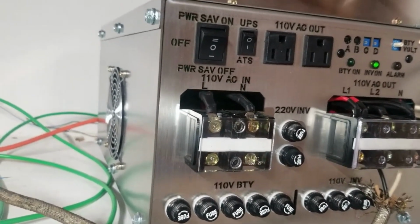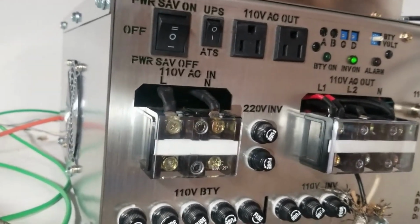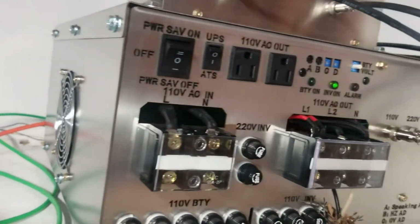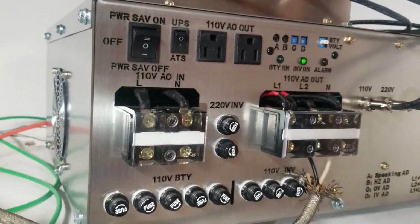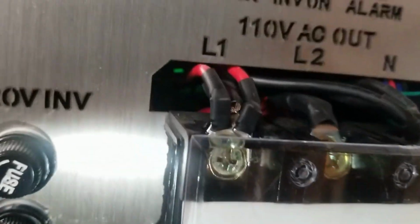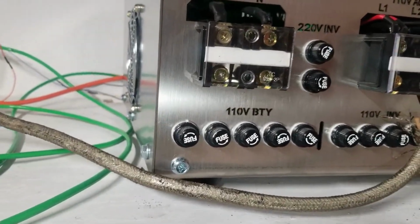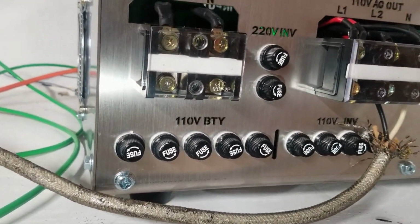And on top of it, this is supposed to be a 9,000 watt. I don't think this thing will go to 5,000. The house goes around 5,000 watts. If this thing dies, it tells you it didn't go over 5,000 watts. I'm not trying to break the inverter. That's the last one I have in here. I'm not trying to break it. So I'm only using one leg. See, I'm using leg 2. I'm bringing only 120 into the house. I think later on I'll probably try something for 220 outside the house. Okay, this is a, what do you call this thing?